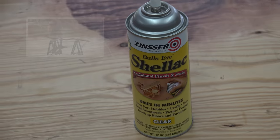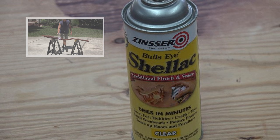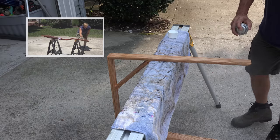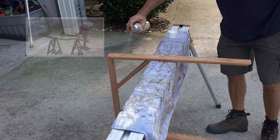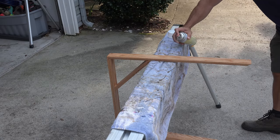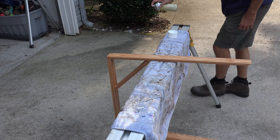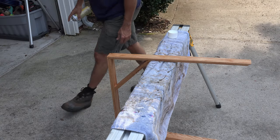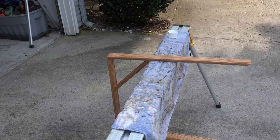For this box I will use classic oak stain — I think this stain brings out the best in oak wood. You can darken it but I think if you do you will detract from the red felt backdrop. Here is another first for me: I just finished making a movie prop from Harry Potter and in that application I used some spray shellac. I think it looks great once dry and it does give some added protection to the wood, so instead of using polyurethane like I always do I will try this with a shadow box.